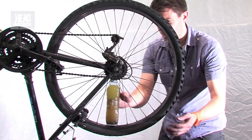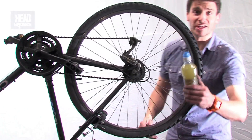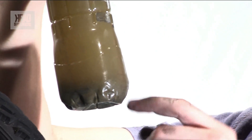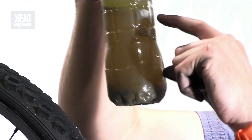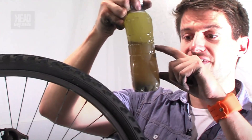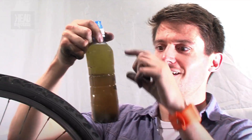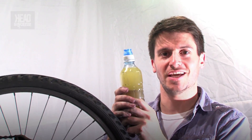That was one very dark, horrible mess. I still wouldn't want to drink it! But you can clearly see that the heavier objects — the sand in this case, but on a ship that's the solid impurities — have been accelerated right out to the bottom of the bottle. Above that, the next densest item, you've got the water, which represents the water in the fuel oil on ships. And then at the top we've got the gold that we're after: the oil, which can then be tapped off and sent to the engines to be burnt.